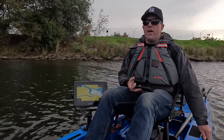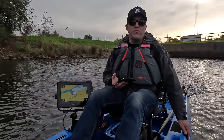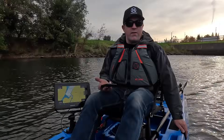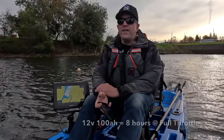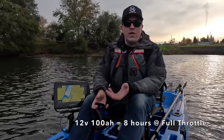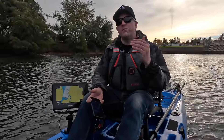So like we said at the beginning, if you run a 12 volt battery we really don't recommend it, but you can. You can throw a 12 volt here and cruise around. What's really crazy is the wattage draw at 12 volts — we're pulling almost 4 miles an hour, somewhere around 3.5 to 3.8, cruising along. And that consumption is only somewhere in the range of maybe 150 watts. By comparison, that's pretty much what a typical trolling motor would get you, but instead of drawing 500 or 600 watts, we're only drawing 150. So that multiplies your run time or it means you can use a much tinier battery.